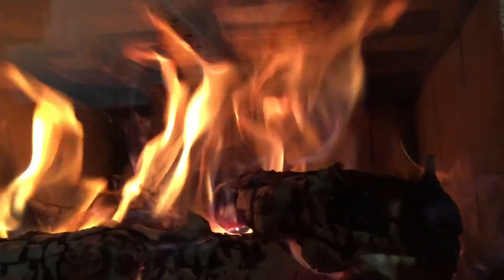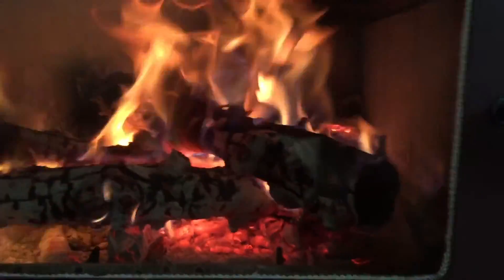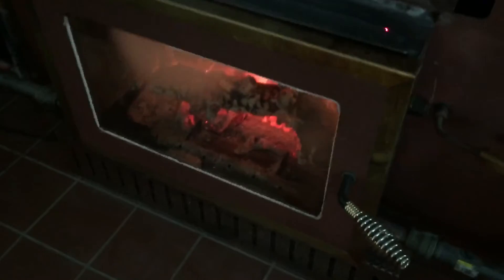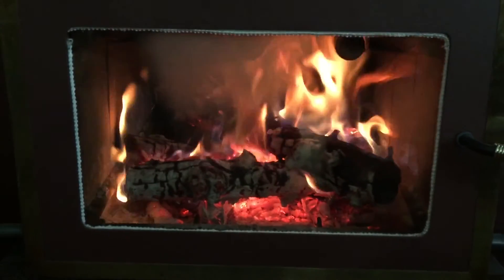You can see those air tubes on top and then the baffle that I put in. I also added some more fire brick. There's a lot of fire brick but there's plenty of heat exchange. Standing right here there's a lot of heat coming from the front, sides, and top. There's another chamber up here that's not insulated at all, so that's all heat exchange. The sides have fire brick so they don't get too hot — before it was warping in the middle, but now it's fine. So there it is: a retrofitted old wood stove that burns clean.